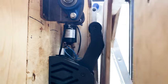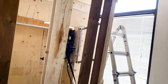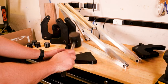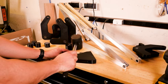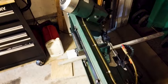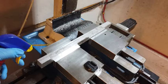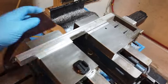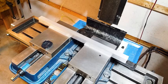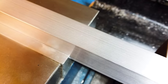My lack of craftsmanship isn't exclusive to metalworking. I also needed something to push the painting off the wall to start the initial motion of the frame, and for that I hammered bearings into some CNC 3D printed parts to smoothly apply pressure to the back of the frame. For the links themselves, everything's made out of 1x1 inch 6061 aluminum square bars. They're pretty dirty, so we cut them to length, spray them with WD-40, and wipe them down with Scotch-Brite — it cleans them up and adds a really nice brushed satin surface finish.